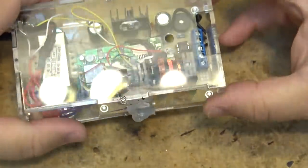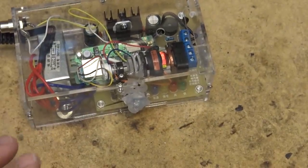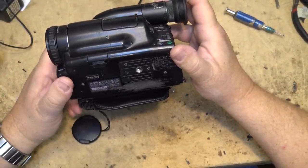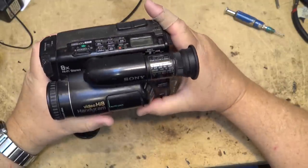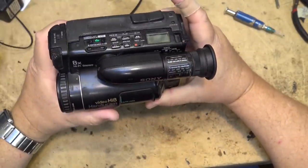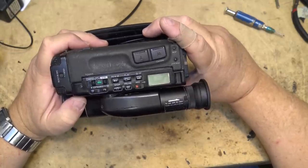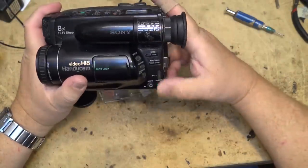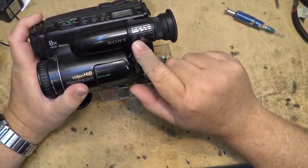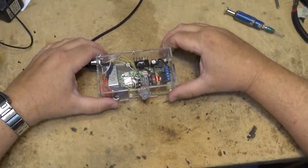This truly is the smallest commercially made CRT in the world — it was used in Sony camcorders. Here's another camera, a 1992 CCD-TR81, the first of the Hi8 Handycams. This is mine, the first little camcorder I bought for personal use. This one uses essentially the same tube — the tube was actually made by Citizen on this one, but it's identical in size and form factor: a rectangular tube.